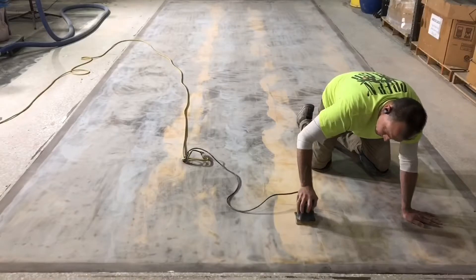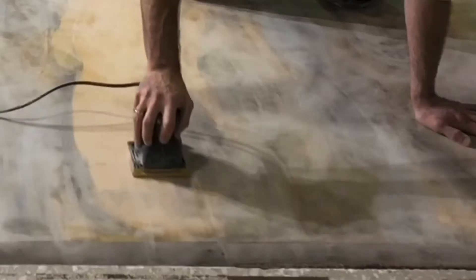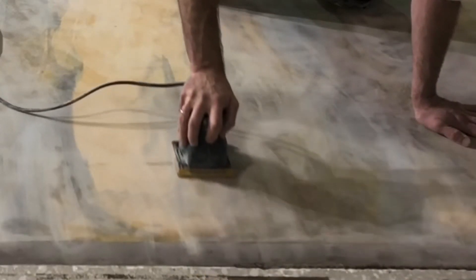If this material is to be used as a top coat, a higher-grit diamond should be used — perhaps 120 or 150 grit. For sandpaper, 120 grit was used here, so 150 or 200 grit should have been used instead. Two coats of urethane are still allowing those scratch marks to show on the unsealed side, because as the urethane cured and the water evaporated, it conformed to the profile of the floor below, causing the scratches to telegraph through the top coat.